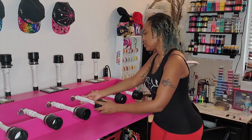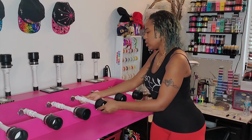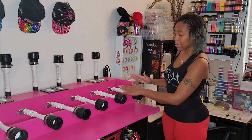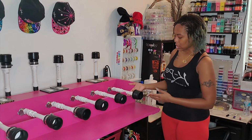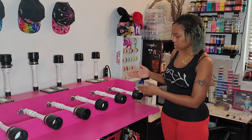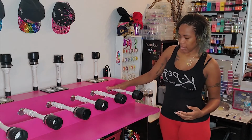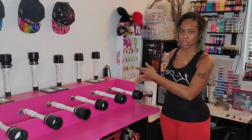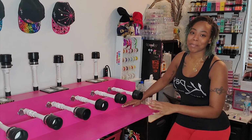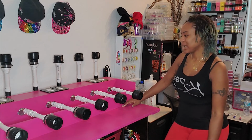The only thing I can tell you is that I used a power drill and a hole saw bit. Use a 1-inch hole saw bit. I had my 5-inch piece, and after I made my markings, I used the hole bit and drilled my hole. Then I used my jigsaw and cut down to the hole, and then I used my circular saw so that it was a half moon, half hole, whatever you want to call it. I wish I had more for you there. Like I said, this is my first time doing this, so my apologies for that, but yeah.